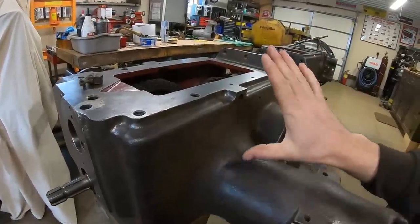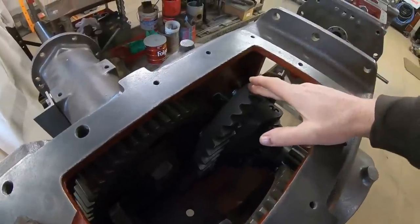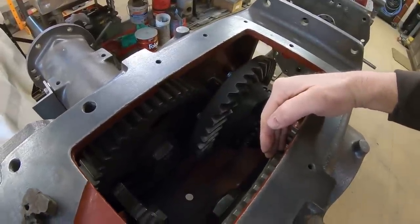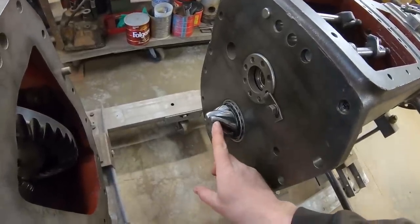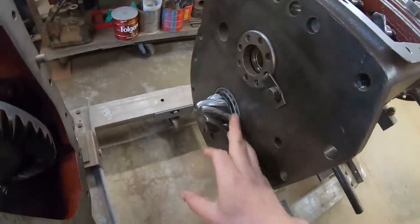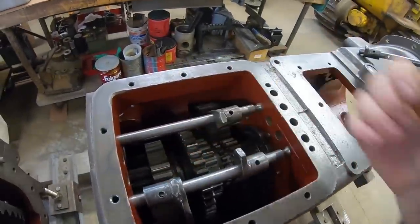This is about where the restoration series playlist picks up — I'll pop that in the description below. We were able to fit production 445 tractor ring gear, drive pinion, differential carrier, and bull gears into this unit. The tooth count is one tooth off between the production ring and pinion and the prototype ring and pinion, but that's okay. Working forward from there, transmission gears were next — a pretty straightforward fit, with the exception of matching the production drive pinion and shaft to the bearing bores of the prototype case. We had to do some creative bearing cross-referencing using certain-sized cones with certain-sized cups, but we were able to fit it all and kept all the 10X prototype gears.